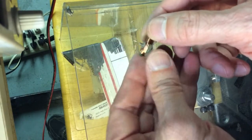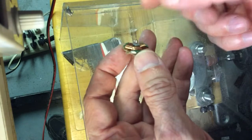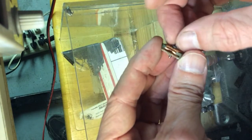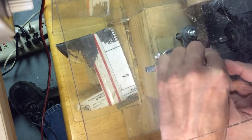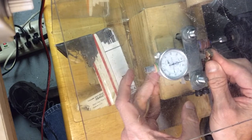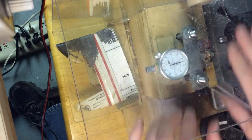Here's my armature. I put a little 25-thou plastic spacer on here just to take some of the slop out when it's in the armature lathe. Hopefully this will all be nice and clear enough. I'm going to put the armature in, comm side this way. Not that it really matters, as long as you're cutting on the entire lamination OD, you're in good shape. I've already adjusted this so it should machine a little off. You can see everything.